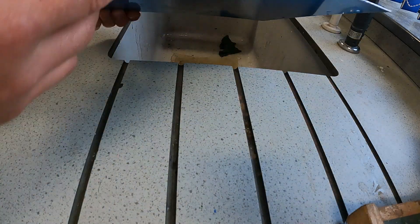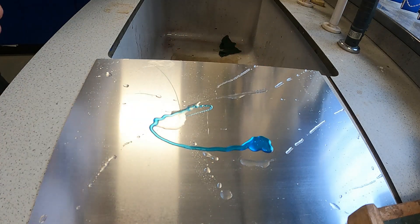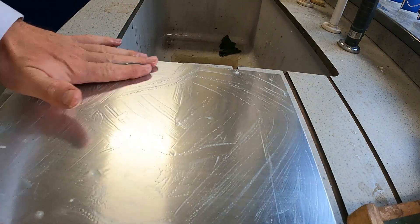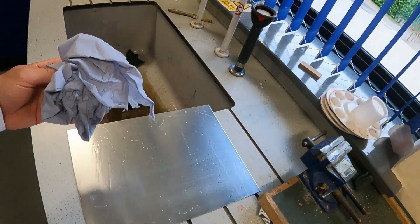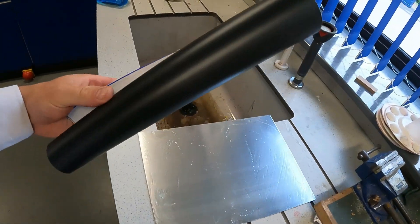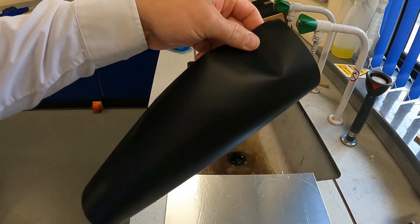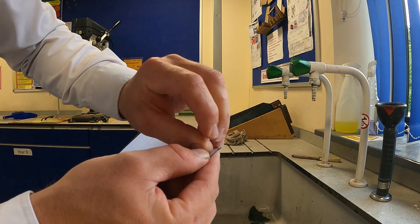It's really important to keep the surface of the aluminium wet, and potentially put some soap on there as well. It will all come out later - it just enables you to move the sticky vinyl around before it sets. When you don't have a squeegee, just use a bunch of tissue or blue roll. Make sure you've got your sticky vinyl ready, and as soon as I peel off the backing I'm going to put water, a spray, and a bit of soap on the reverse side to reduce the stickiness.